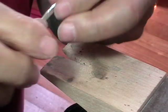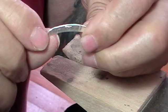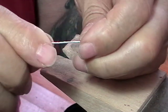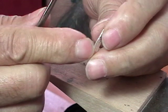So that was 5 or 6 seconds per piece. It's annealed. Quench it, and we'll continue. So these are quenched, dried. They're not pickled. You don't have to pickle fine silver because it doesn't tarnish. Now we're going to open these. We'll start to open them.